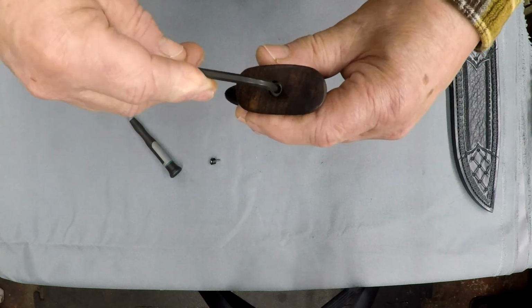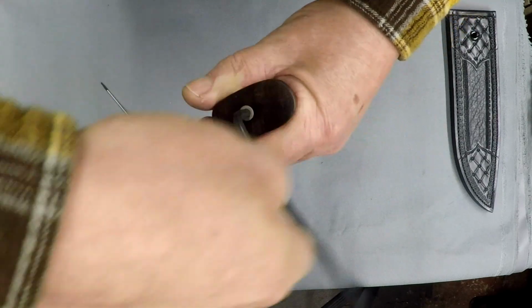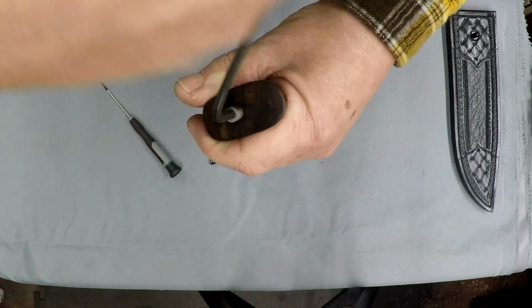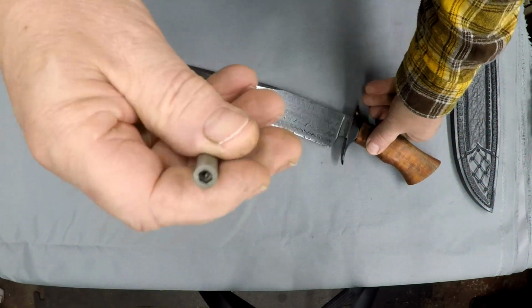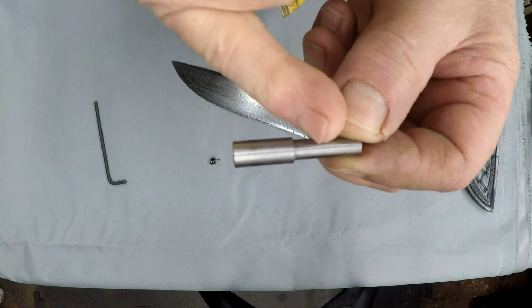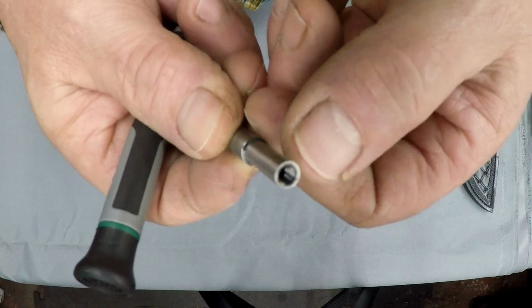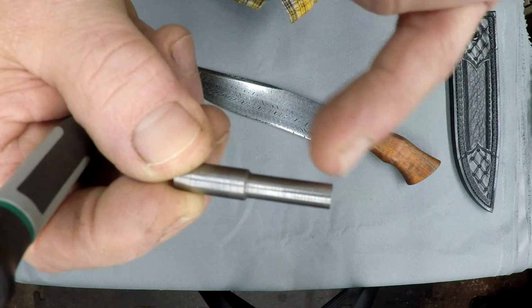A gadget I assemble with my lathe and some acetylene torch and silver solder. It's a 10-32 thread, as the tang is threaded. This I want to show a buddy of mine. So this is a 5/16 stainless rod that's tapped 10-32 to match the finial. I turn this down to about a 1/4 inch.